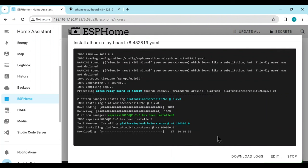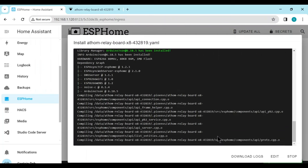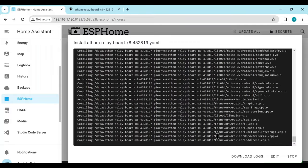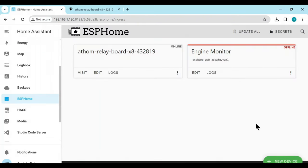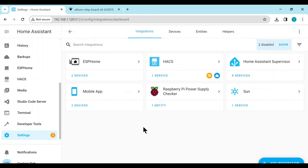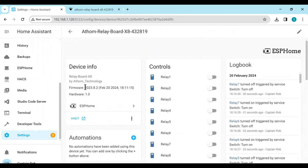This will take about 7 minutes, but I'll speed it up. There will be pages and pages of messages, but as long as there are no errors in red, it should be fine. At the end, you'll see a success message in green, and then it will try to connect OTA — over the air. If you stay on this screen, the logs will be displayed. The beauty of this pre-flash board is that we do not need to touch any ESP Home YAML. Here you can see the relay board is successfully online. In Settings, then Devices and Services, then Integration, let's select the relay board entry. Here you can see the in-depth device info and also the 8 virtual switches that have been created.